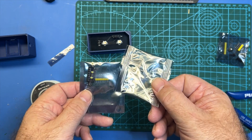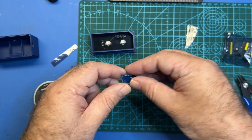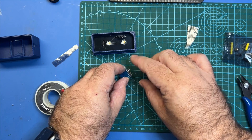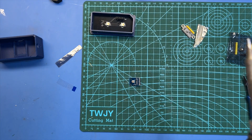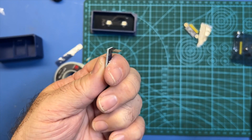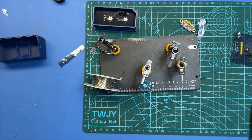Next up we're going to need these two boards: the color sensor and the lux. We're going to be soldering the headers to these. I went ahead and prepared the header pins. Make sure it's oriented like this — the longer ends are on the side with the lettering for the lux piece, and short ends on the other side. For the color sensor piece, long ends on this side and short ends on this side. We're going to tack one pin, start with this piece, make sure it's 90 degrees, and then solder the rest. I'm going to just set it on my table like this — I won't worry about the 90 degrees until after I solder the first pin. I've got that first pin done; you can see it's a little bent, so I'm going to adjust it while I can. That looks pretty good — a nice 90 degrees. I'll go ahead and put this in my helping hands and finish up the soldering. This is how you want it to look.